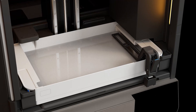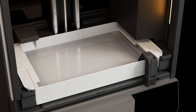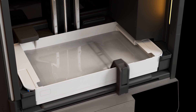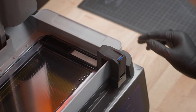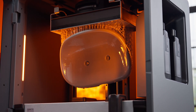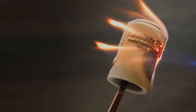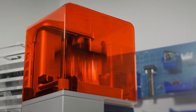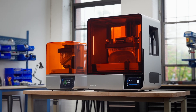The mixer is attached directly to the printer and rests inside the tank, guided by a motor for precise movement. The mixer has many different purposes: it maintains a homogeneous resin mixture, spreads resin across the resin tank, removes debris from the printing area, and flags obstructions on the build platform and tank film. The amount the mixer moves will vary depending on the resin used and other print process variables. You could see no mix between layers, a single swipe, or a double swipe.